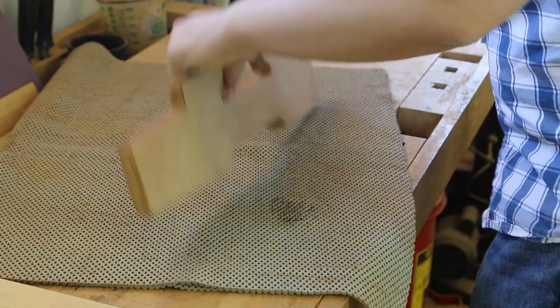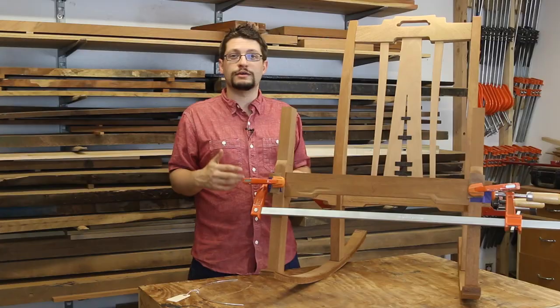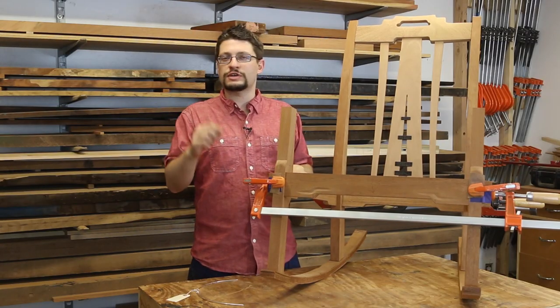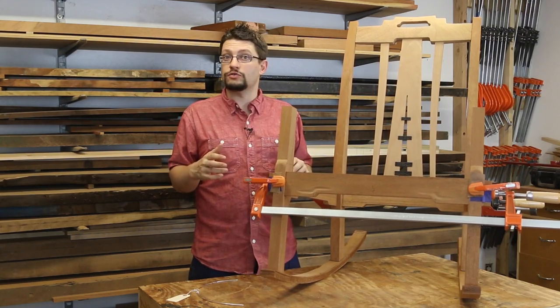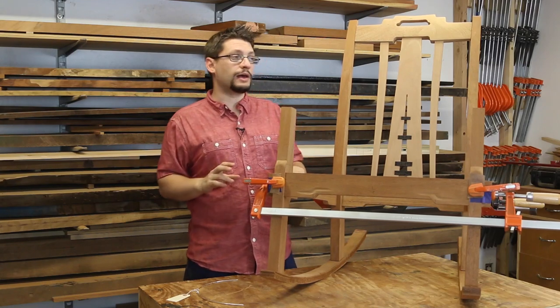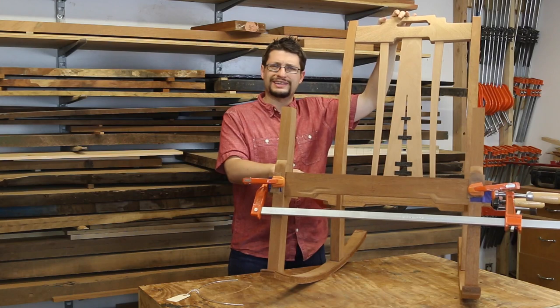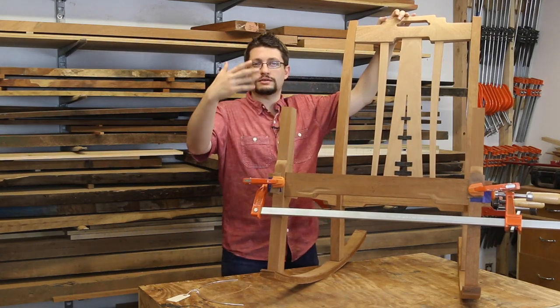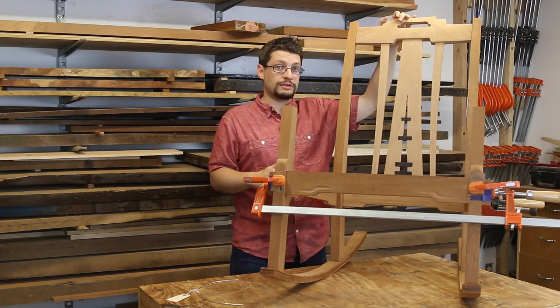I finished sanding this piece as well. When I was finished sanding it, I also shot a quick tip, so if you guys haven't seen that quick tip you should check it out — it's about sanding curves. I have some great stuff about using a sanding pad and how you can keep from getting flat spots on something that's very curved like this, even with a little bit less curves, when you use a random orbital sander.